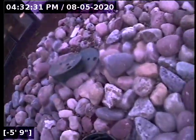This one over here also has an open top, and the one near the street edge is broken, has no cleanout on it either. I recommend the spot repair to fix the belly, and that all these cleanouts out here get caps and flanges put on them. And I highly recommend re-scoping after any repair work is done to it. Ensure that it was done correctly and you don't have a belly in the same location you already did. That does happen from time to time.